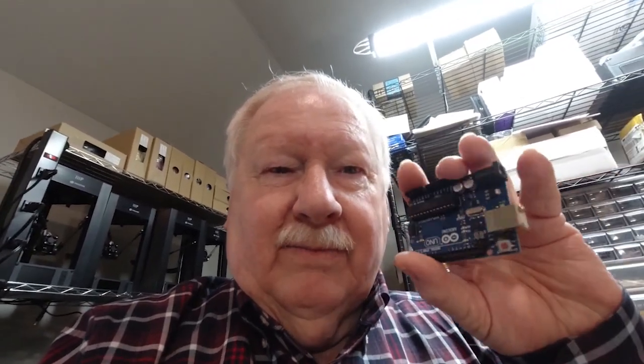With the use of this process controller, we're going to eliminate a lot of the steps that I have to go through with that manual filament counter, because it will have a motor. Right now I have to calculate how many pulses I need to spool off 24 or 42 meters of filament. This computer will do that for me. It'll do the math. All I have to tell it is how many meters I want.